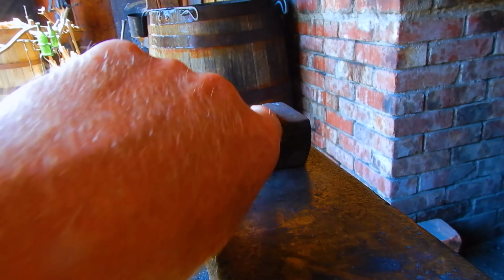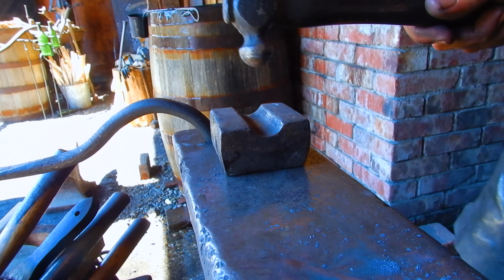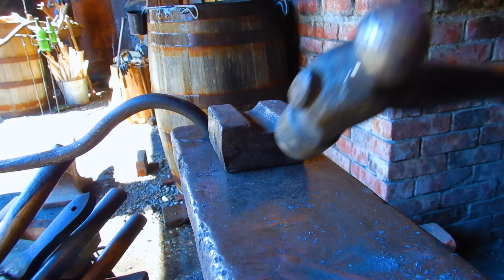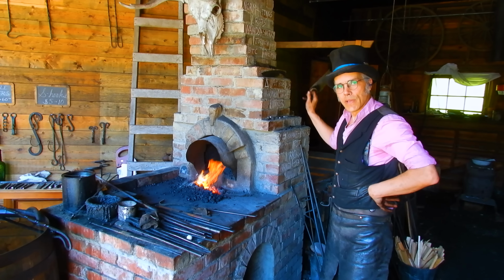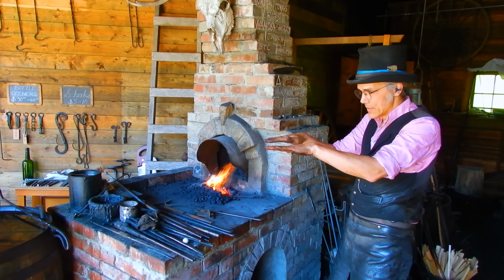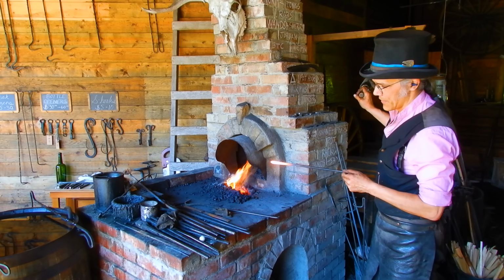So you're just going to put the piece right in there and hammer it down with sort of an inverse of that same shape. There you go. Exactly. And now that the metal's thin, it probably heats up a lot faster. It does. And it catches more hot air coming up if you lay it down flat side like this. So you want to put it in this way, not this way.